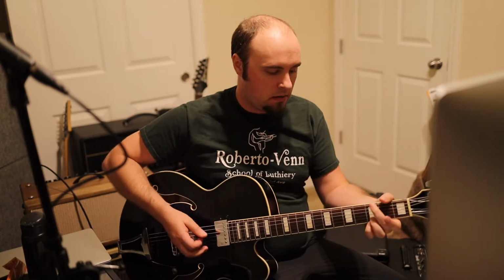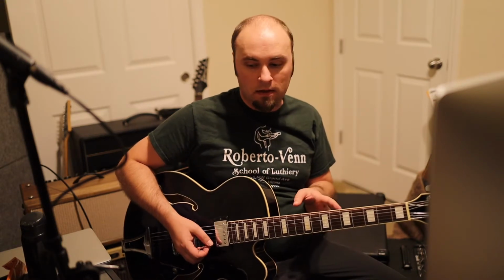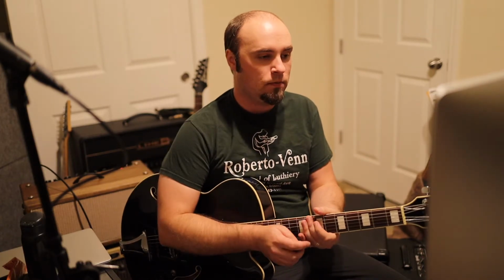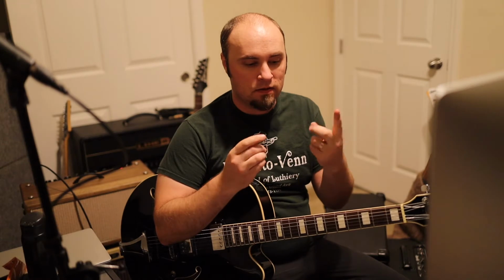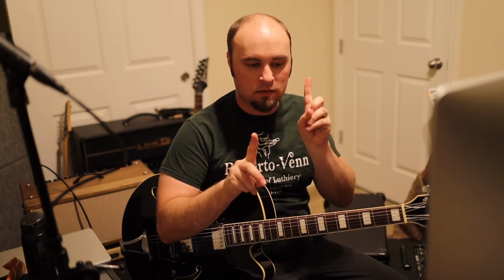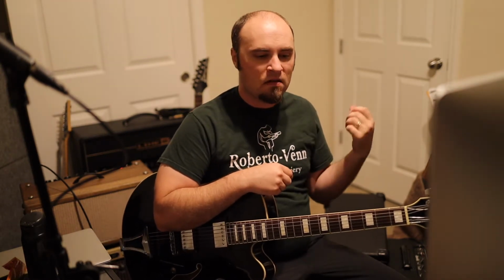They started improving on the amp design. They started utilizing higher and higher powered amps. So not just an amp with a single output tube, but two or maybe even four. And the output tubes would have been in what they would call class AB. So AB meaning that the tube is on, and then this one's off, and then this one's on, off, and then this one's on. So they're constantly going back and forth. Basically alternating current. Just like we utilize today for our power.